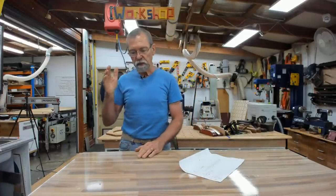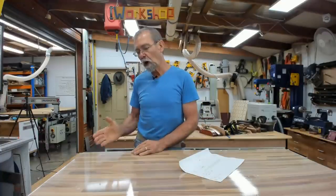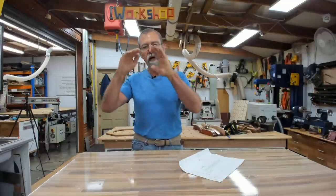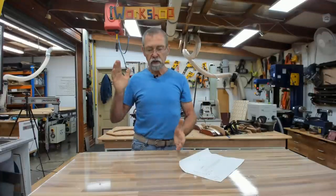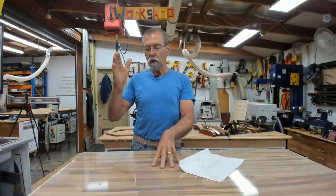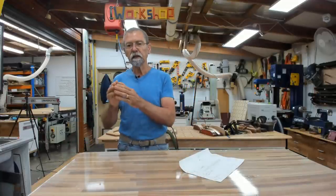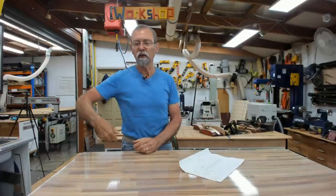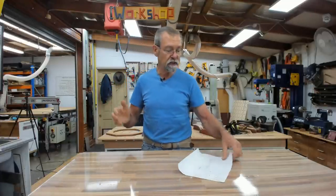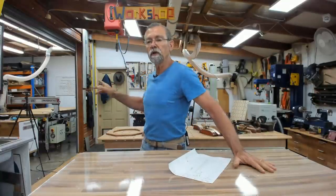We're going to create some 3/4 inch or 19 millimeter thick pine dividers. And we're going to put a half round on the top. And so it's easy enough just to pop those in. The reason I've done the contact is so that when I come to gluing them in, I probably won't glue them during the show today, glue it up next week or during the week, I don't have to worry about cleaning along. There's going to be a lot of dividers here. So I thought it might be easier to put the clear contact on prior to putting on the machine.